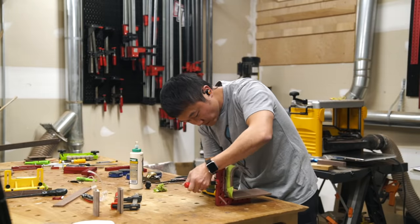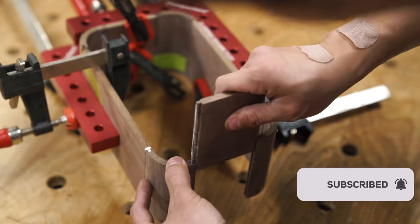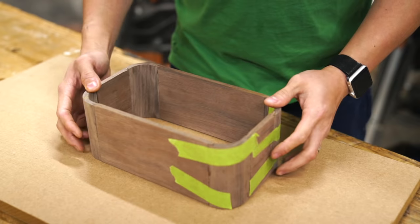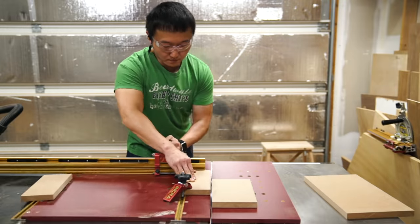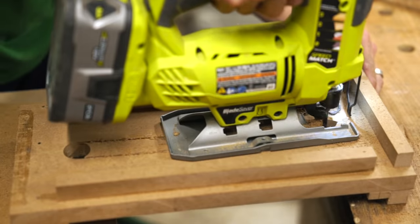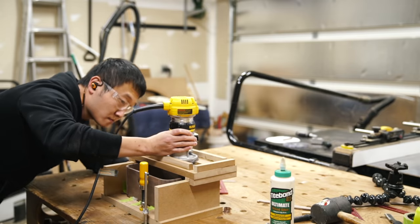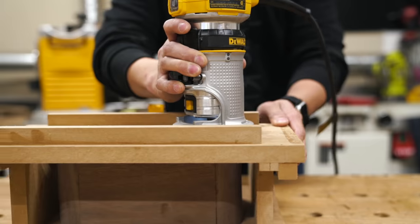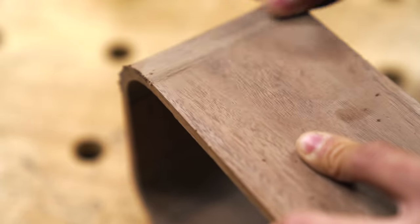If you're enjoying this video, I'd really appreciate a like and a comment below, and don't forget to subscribe to stay up with all of my future builds. The next day, I removed the clamps from the glue up, and as I suspected, the top and bottom edges really weren't squared up. So I decided to build a flattening jig to fix this — it took maybe 15 to 20 minutes to make with some scrap MDF, and it made it really easy to flatten both the top and bottom edges and to control the amount of material I had to remove. Once the edges were flushed up and sitting flat, I used glue and some of the dust from the flattening operation to fill in the gaps between the joints. And once that's done, the hardest part is pretty much complete.